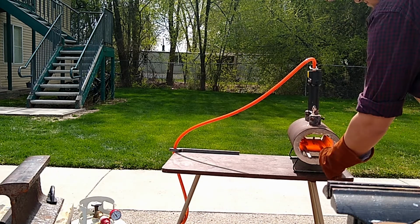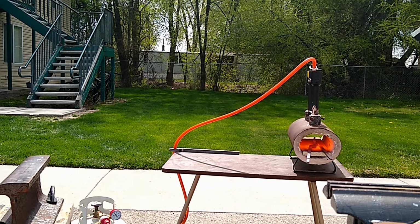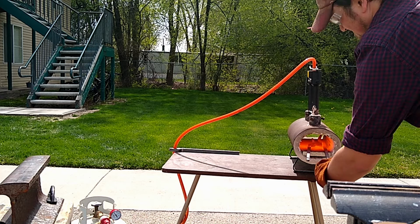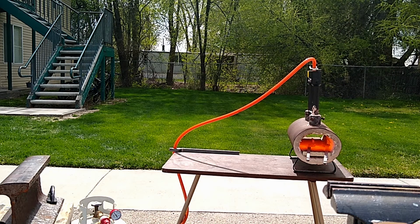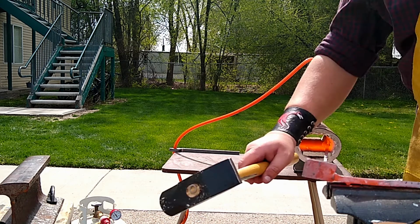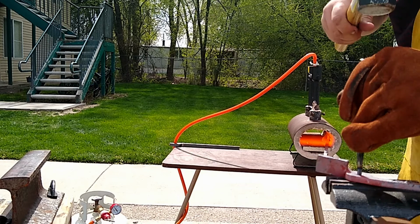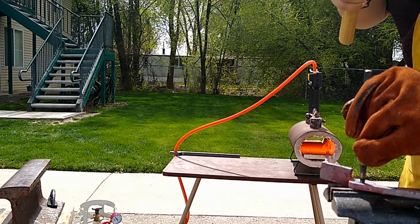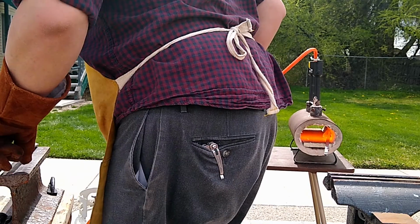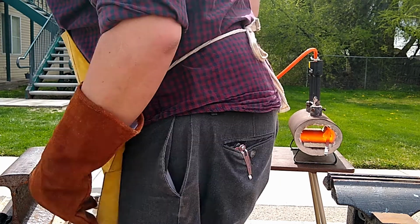So I managed to cause the material at the end of my punch to swell quite a bit. This is called upsetting, by the way. I'm going to do it on purpose later on another project. But on my punches, I'm not terribly happy about it. So, at some point, I need to heat treat my punches. This is the same as you would do with a knife. You get it hot enough that it's non-magnetic, dunk it in oil, let it cool off, and then temper it. In this case, the tempering doesn't have to be exact. You just do it with a torch or something. But yeah.